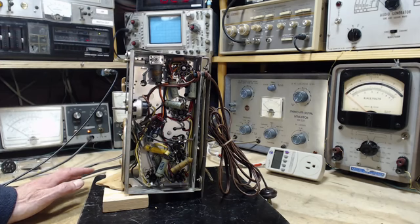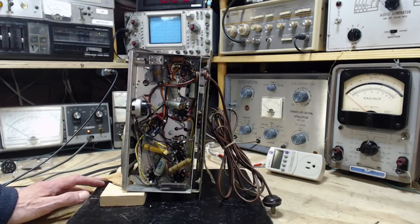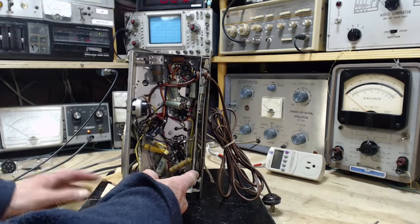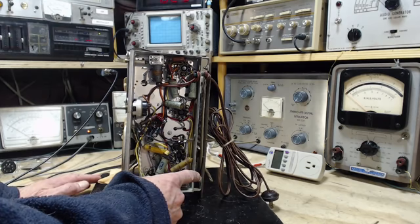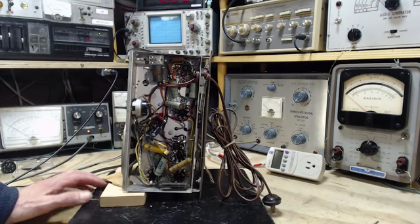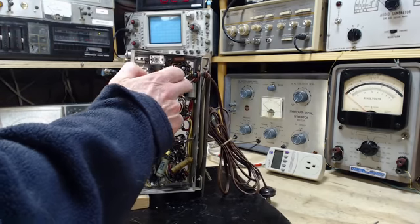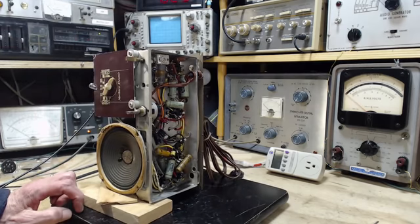The low frequency stuff, like 60 cycles, like the stuff in your outlet, looks at that capacitor as a much higher impedance. So if you do draw current from the B minus through the capacitor that's connected to the chassis by touching it like this and grabbing your local water pipe, you'll only draw enough current to make you jump. You won't draw enough current to kill you. That's the theory. Often these capacitors are paralleled with a 500,000 ohm resistor or so. Not always, but often.